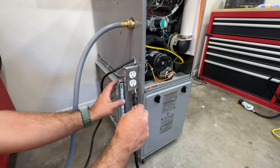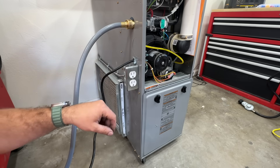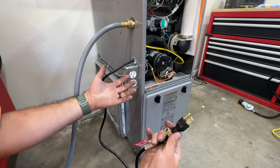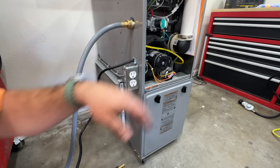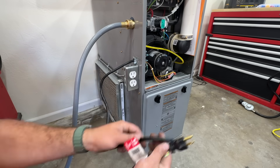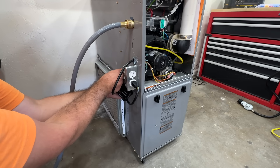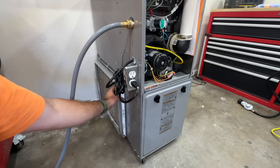Code requires a means to disconnect the furnace, and with this setup unplugging the cord is that means of disconnecting and killing power. As for cord length, you have plenty to reach a power station within about nine feet, but you can make it however long you want or trim it shorter. Under normal operation you can spool it up and keep it zip-tied next to the furnace. I'm going to zip-tie it to the MC cable for the grid power to keep it out of the way while still allowing easy filter access.